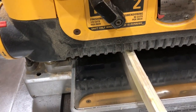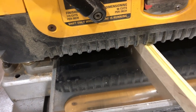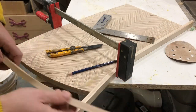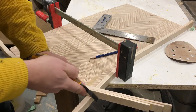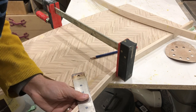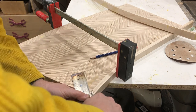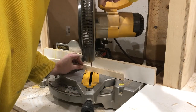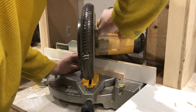The width of those laminations is about a sixteenth of an inch thicker than the cutting board itself, so I run them through the planer just to clean them up and get them ready for miters. I use a pencil to mark the location where to put each of the curved portions, but I use a knife to mark the actual angle. I take it over to the chop saw and as long as you follow the line you'll be close. I usually make them just slightly proud so I have a little bit to trim if I need to make any adjustments.